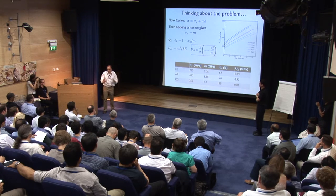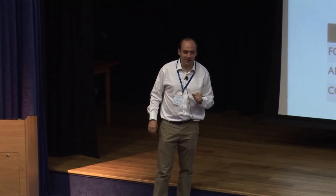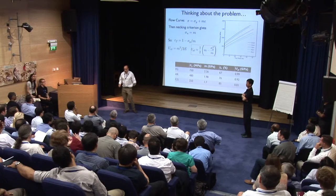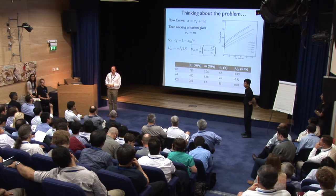There is probably more to the story, for sure. But the first part of the story is you'll lose quite a bit of the ductility just from a necking argument. And you can't beat necking, unless you can suddenly add hardening late in life. But you've already used up a lot of the subdividing you can do. So, to a first approximation, that would be my view on what's going on there. But it is a first approximation.